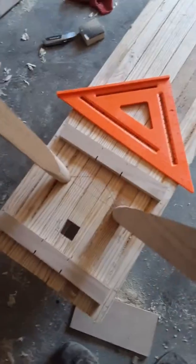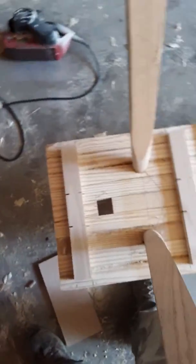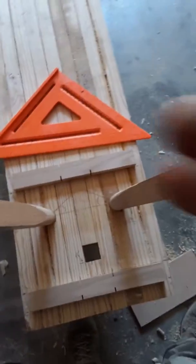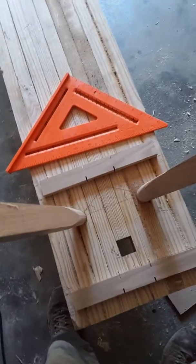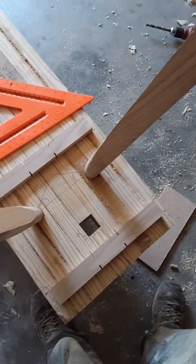I trimmed off the top of the legs flush with the top and smoothed all that down. I figured that since the legs are providing upward thrust and the weight of whatever you're working on plus the shock of whatever you're doing is providing downward thrust, what's actually going to happen is the bottom surface is going to be under tension and the top surface is going to be under compression.